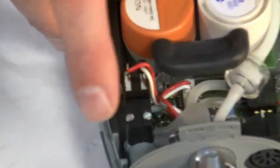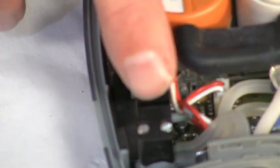The instrument also has a pressure sensor. You can actually do a draft test with the instrument, a differential pressure test, and you can also measure gas pressure using the pressure sensor function in the instrument.